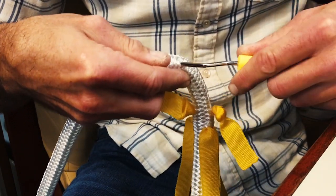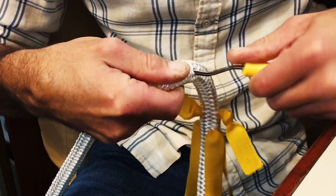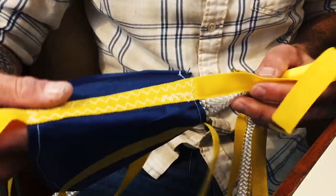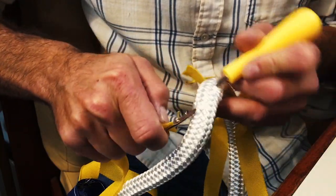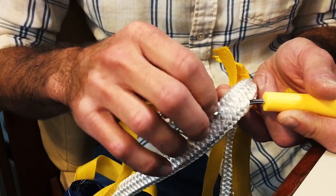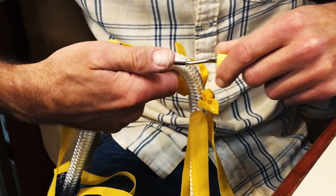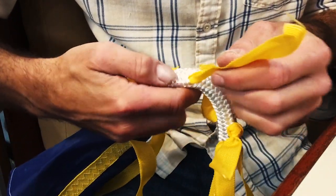Turn the rug hook about 45 degrees so that it comes out through the braided line at an angle — that's really important. Then find the end of the next cone, grab your piece of nylon, and get it in through the rug hook, actually penetrating into the nylon. Close the little clasp over the nylon and pull it sideways through the braided shield — it should pop right out on the other side.